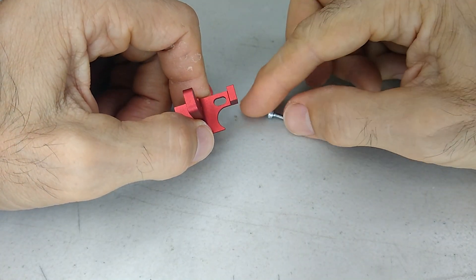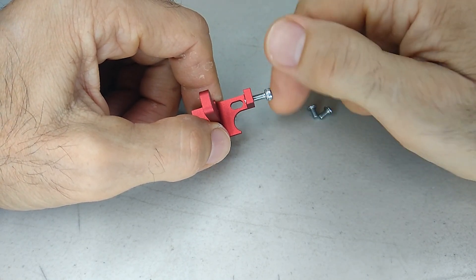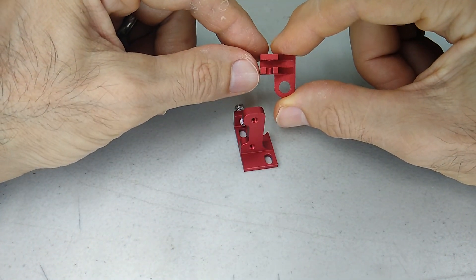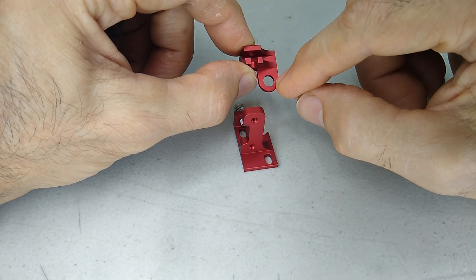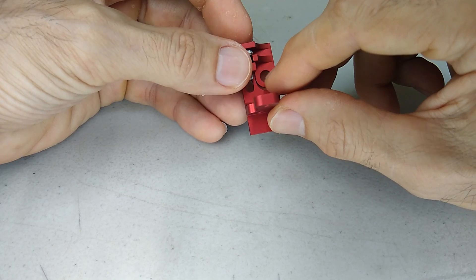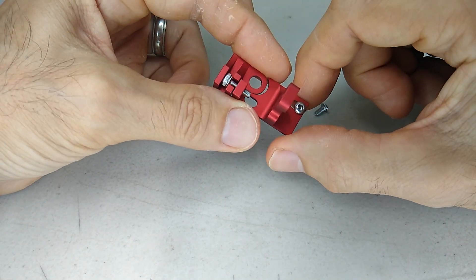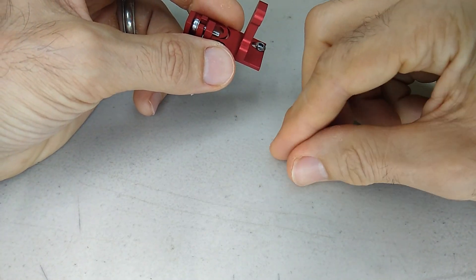To start, take the longer allen screw and thread it into the little arm at the top of this part. This is the piece that holds the probe, and then you have the other section. This section uses the left top wheel bolt on the Ender 3 gantry to fasten this part. The allen screw gets trapped between those two fingers, allowing for adjustment up and down. This lower part rides on these two screws. If you have an Ender 3 or Ender 3 Pro, you'll only have one screw hole on the right side, so you would just use that one. If you have an Ender 3 V2, then you would use both screws.